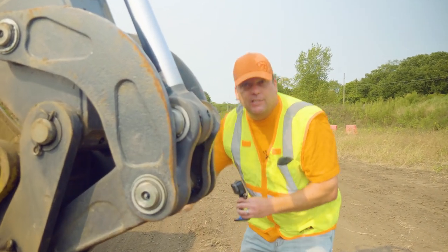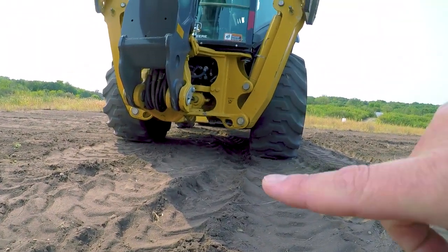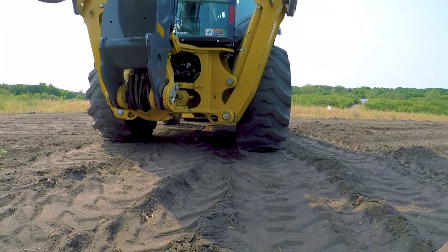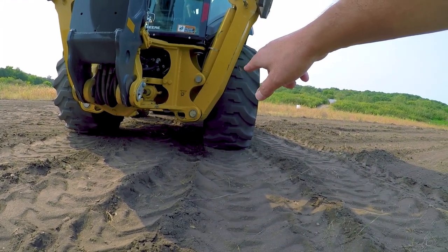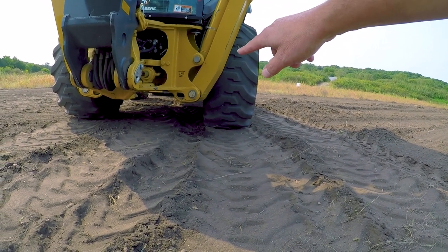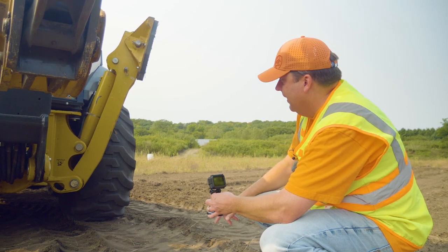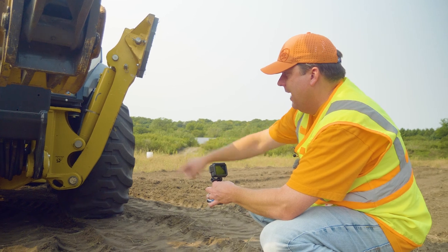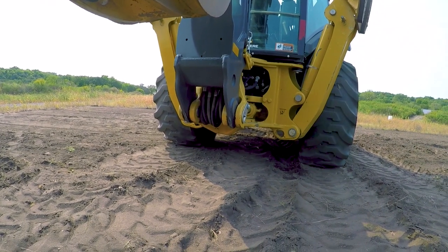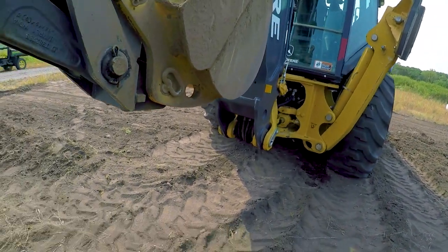While I'm around the back, I always like to look underneath the equipment. If it's been parked for a while, you can see if there are any leaks under the cab. On this one I can see a little dripping — it's actually water from the air conditioner since we were running it earlier. But you can tell where it's at: if it's under the engine up front that's where you'd see engine leaks; directly under there would be hydraulic lines. You want to make sure there are no leaks and none of the lines look damaged.